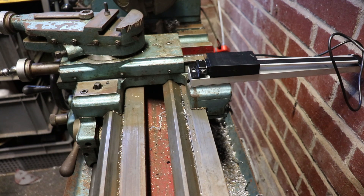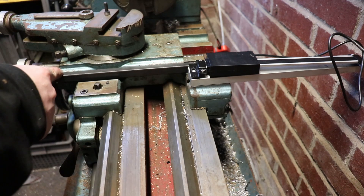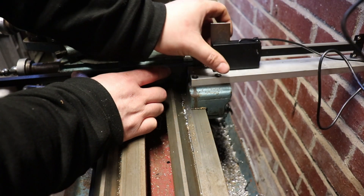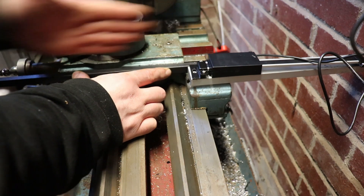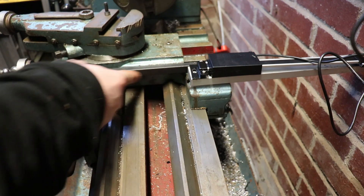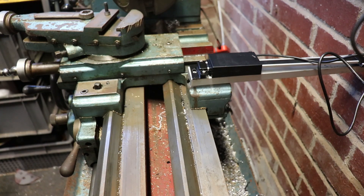What I'm going to do is cut a piece off the right length that will sit on here. It will bolt through the sides, and then this plate here will bolt through and onto there. Hopefully that will give us a straight line push to accurately measure. I'll only be losing 12mm when my tailstock comes in, which I'm not that bothered about because nine times out of ten there's a chuck in it anyway. I think that's going to work quite well, so I'll cut a bit and then we'll mark out.